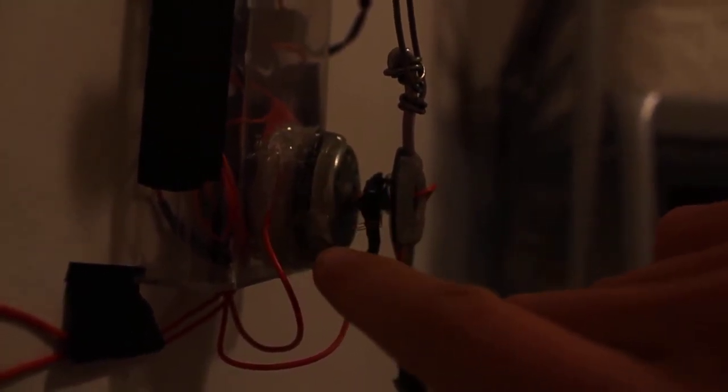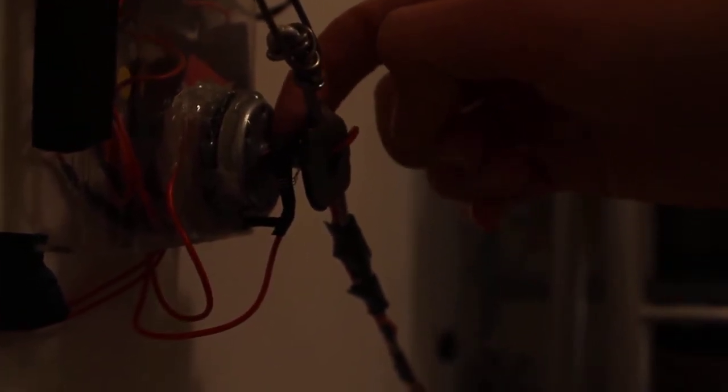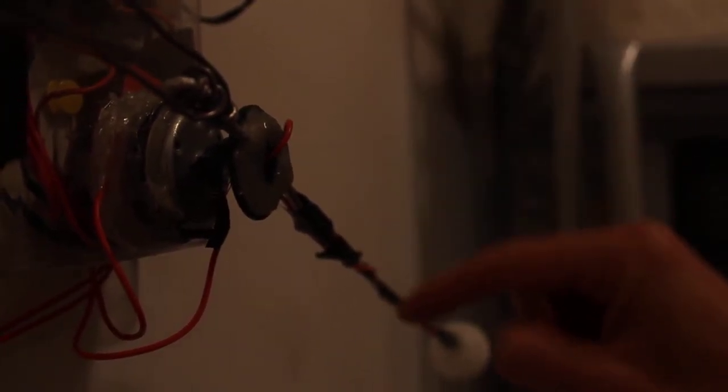And the way I did that was right here. One wire goes from the microcontroller and is soldered to the side of the motor. And that sends electricity to the whole outside of the motor, including the shaft of the motor. So I just have the second wire that goes to the LED attached right here through the middle to the shaft. So that's one connection, and that is a connection that can spin.